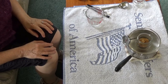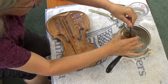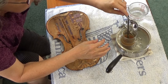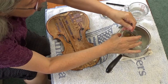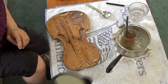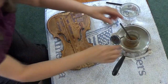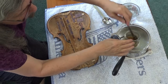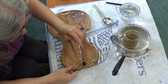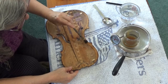Then you have to wait a little while for the glue to warm up and give it a bit of a stir. The more you stir it the more it thickens and evaporates, so not too much stirring. If it's too thick you can add warm water — don't add cold water. You might have to add more hot water to the outside bath to keep the glue from cooling down. Once you start putting glue on the surface you've got to work quickly, because if it cools down it'll solidify and won't stick.